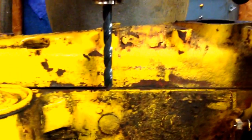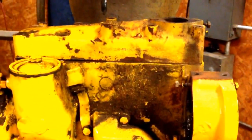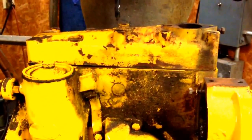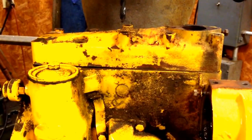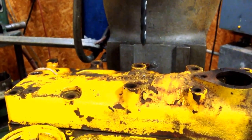Got my 3/8 drill in the 3/8 collet and set my stop — right there. Now I know I'm not going to drill into the deck, and I'll be able to use an easy-out to extract the remnants of those busted studs after I get the head off. Let's locate and start drilling.